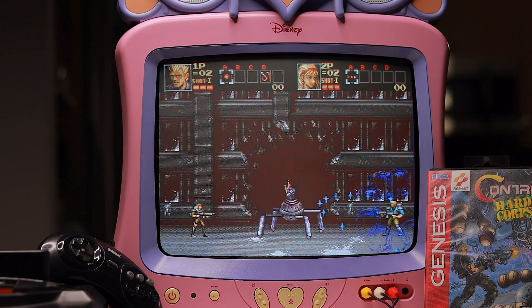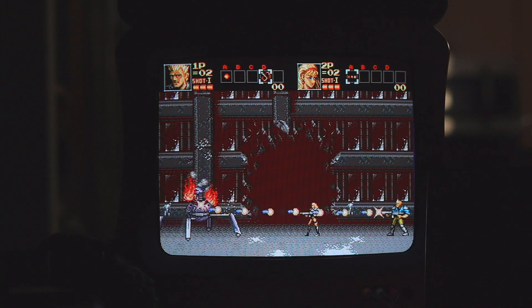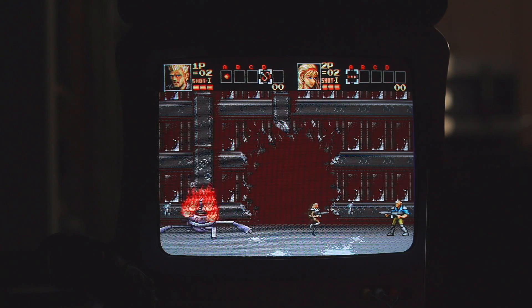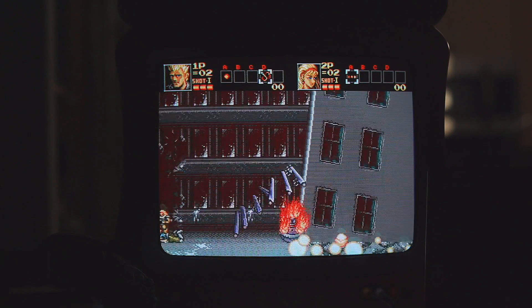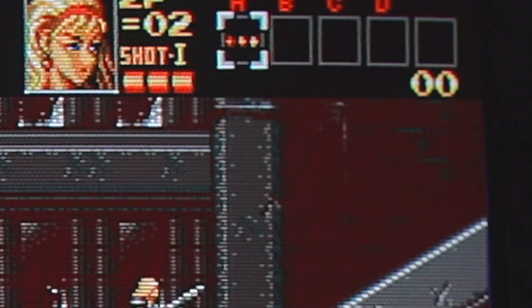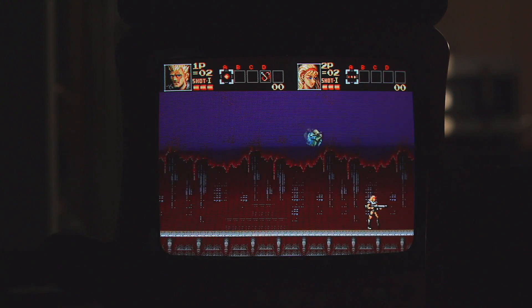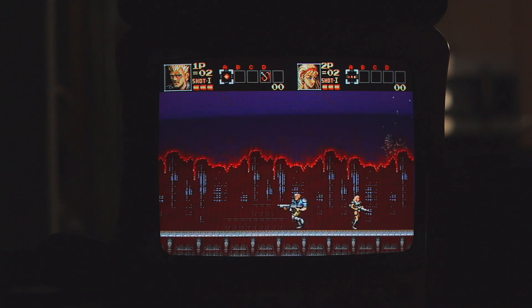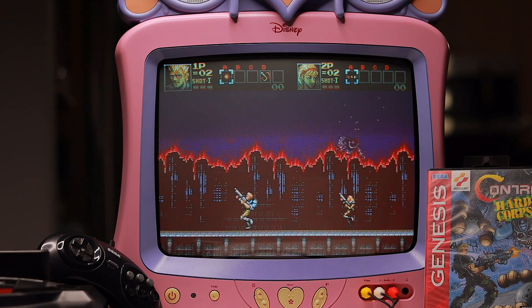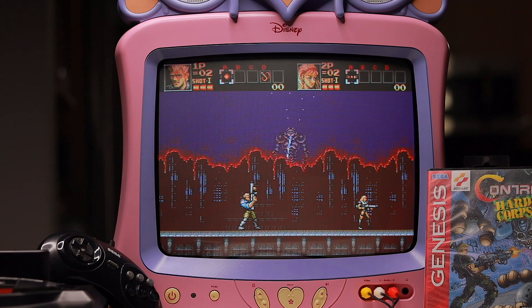Notice the box for the portrait of the male is wider than that of the female. Horizontal linearity issues like this almost always are present on Orion tubes — yes, this one has an Orion tube. It's always wider on the extreme left side of the tube. Frustratingly, almost all TVs do not have a horizontal linearity adjustment.